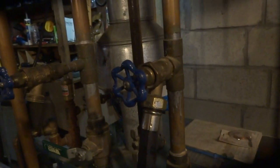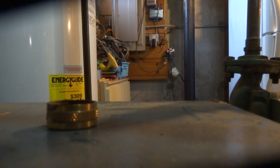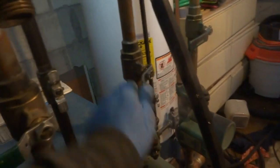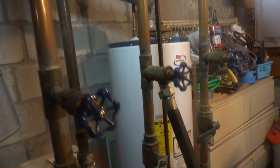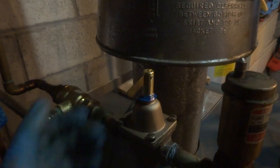I'm going to replace the bad parts and get it going. Going up through the supply, through the house, back, and purging the zones — doing all three. You can hear the difference now with the new feeder and the new 9D. I didn't make a combination one, but I'll just use the 9-11S on my other job. You can hear it quiet down — we'll move it over to the other zones.